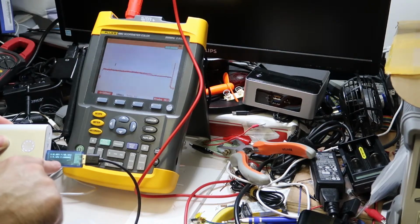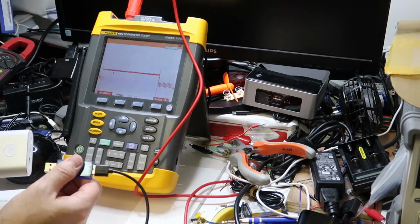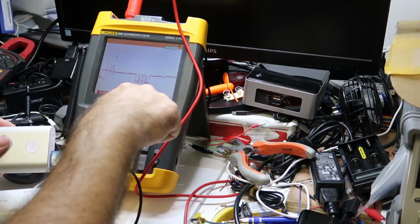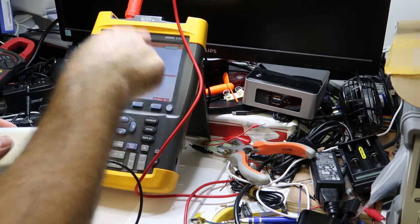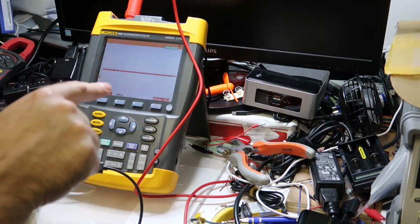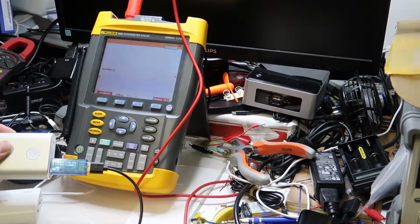Okay, so this is 5. Now it is 9 and I didn't manage to see the request. Let's move the timing a little. And again, this is the request. The voltage is still a little low. And now after the peaks, yes, after the 5 peaks it moved to 9 volts. Okay, so the first part, as I said, is the request from the Anker, the signals that we're seeing, and the feedback, which is the 4 peaks, is yes, I support this voltage.